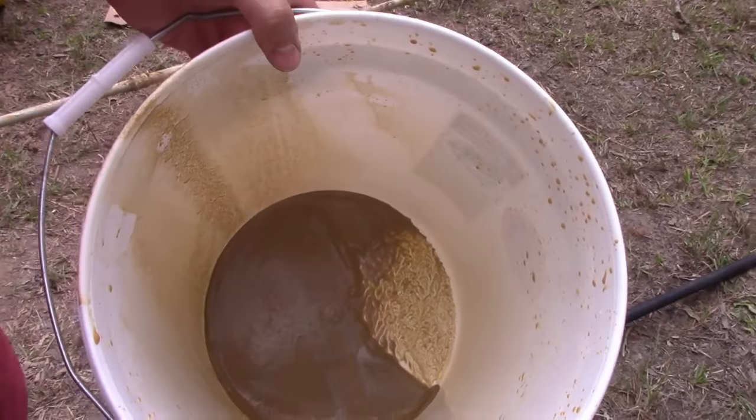Well, minimal sand. The whole process took, I'd say, about 3 full days of digging, but we also had a lot of problems with the sand strata layer kind of collapsing over and over. We had to dig it out a few times to get it to stay stable enough to put the casing down. So you're looking at about a 3-day project. Again, I think totally worth it.